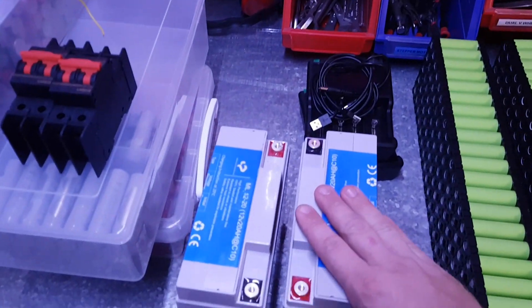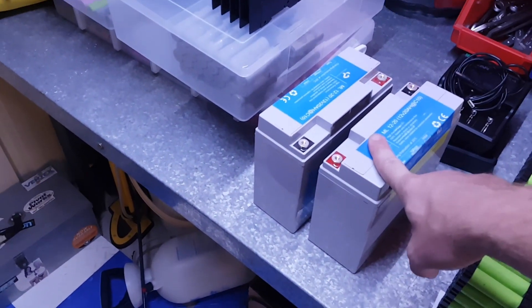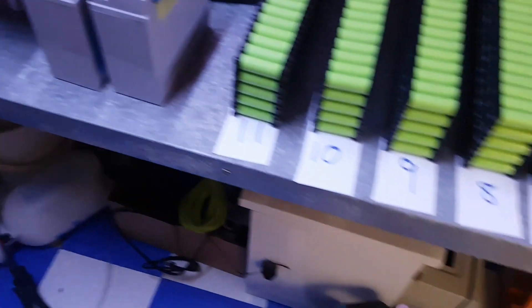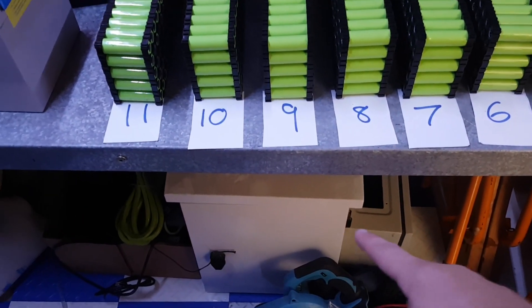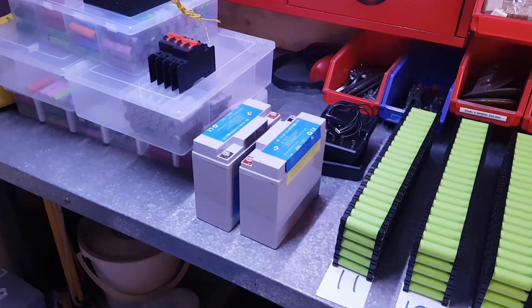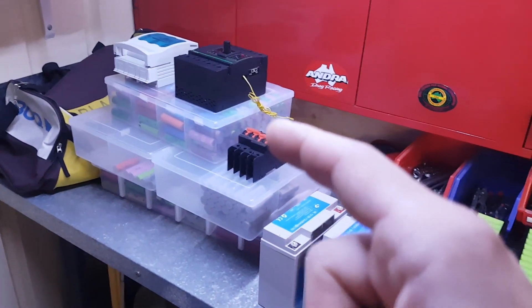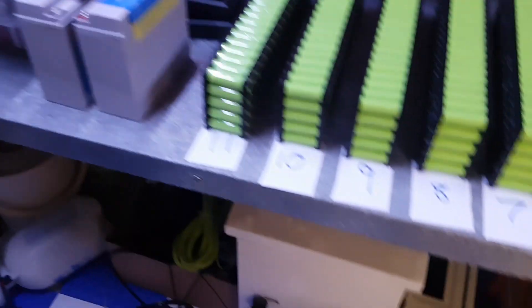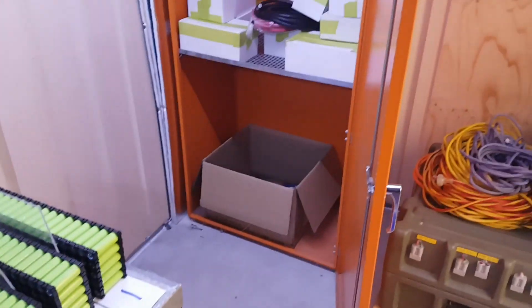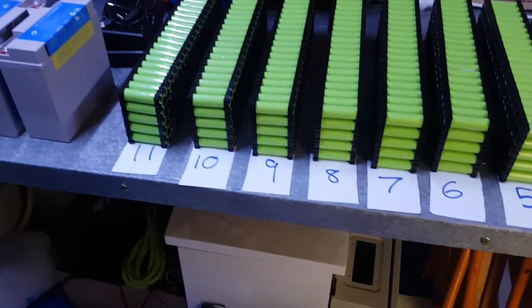However, I've decided to go down the path of using a separate power supply — two 12-volt SLAs. They'll give us 24 volts. I'll mount them down in one of these cabinets and give them a nice little trickle charger off a solar panel, so we'll just trickle charge those. Have the BMS powered off there and the trip shunt powered off there, and we'll separate that from the main cabinet. That way if we get any failures over here, these cabinets with the SLAs will be good to go.